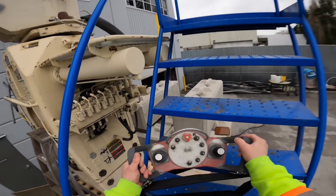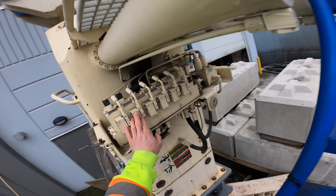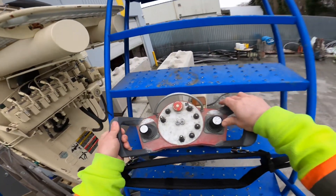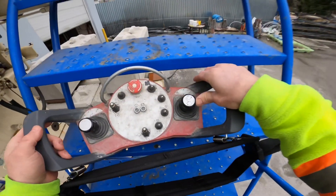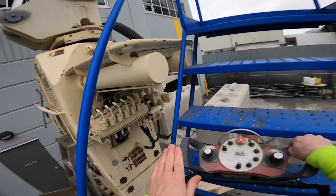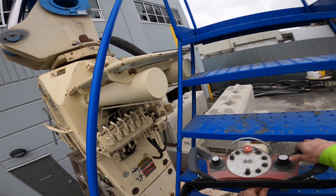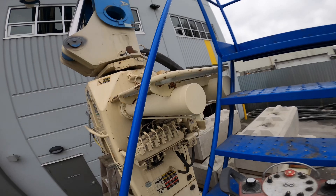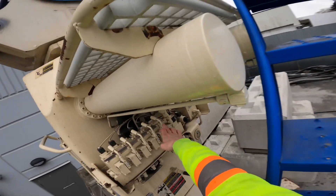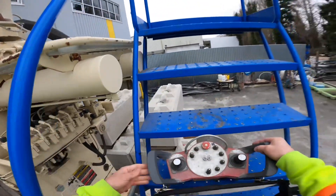Okay, the last thing I'm going to tune is my engagement point for the slewing. The slewing valve is this one right here — that's my pilot valve. The pilot valve opens up and provides pressure to all the boom valves, and then based on what section I'm moving, that's the individual valve that'll move. Here goes the battery again — let's get this done quick. Right now if I go left or right I just touch the stick and it's really kicking on hard. For slewing that's not what I want — I want it to ease in nice and slow, so that boom isn't jumping around at the end.